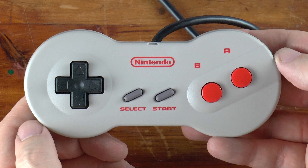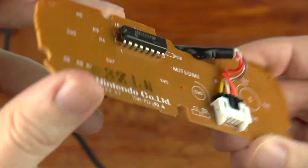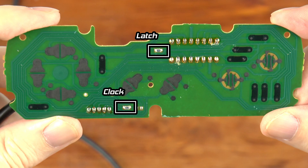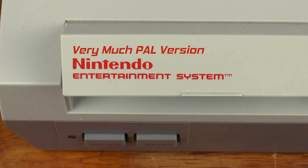As an addendum, I wanted to show two PCBs from later controllers. The Dogbone NES 039 controller with a PCB from July 1993 has the same shift register package as the original controller, but also has two extra components: a pair of resistors, one between power and latch, and the other between power and clock. An original rectangular controller for NTSC NES is incompatible with the PAL control deck, but you can add two resistors in those same positions — built into the Dogbone by design — to add PAL compatibility while still working on your NTSC console.